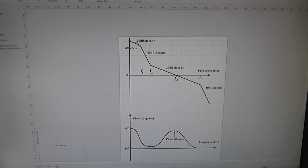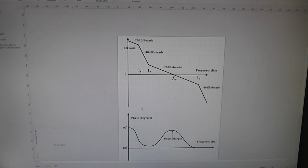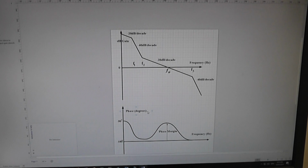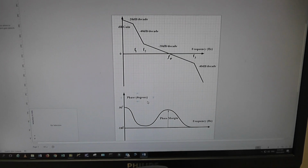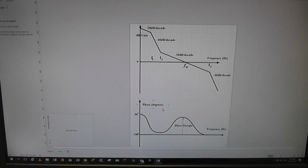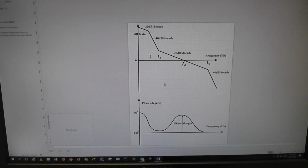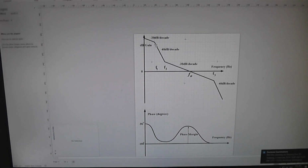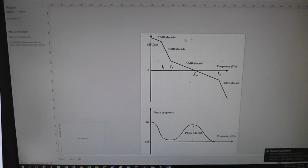If you put two integrators, you get even more gain, but you don't gain a huge amount. But with two integrators, you should be able to follow without any error a ramping input. This is classical control stuff. They talk about ramp error coefficients and so on. So you've got two integrators, but if you've got close to two integrators, you can do the same thing anyway. You just don't get quite zero error.